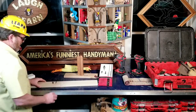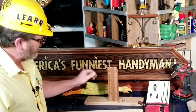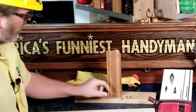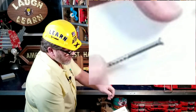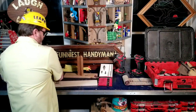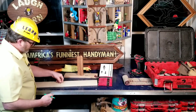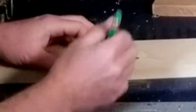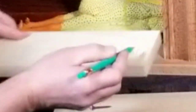I'm going to attach these two pieces of 1x4 using drywall screws — I'm going to use three screws and I'll show you why. Then I'm going to attach this stain grade handrail with three trim head finish screws. If you take a good look at these trim head screws, they have a very small head — much smaller than a regular drywall screw — and that can come in real handy when you want your screws to disappear after you're done. First thing I want to do is get my small bit out. It's a good idea to mark where I want these guys to end up, so I'm going to mark these spots and flip it over and mark one right in the middle. That mark represents where I want the head of the screw to almost end up.